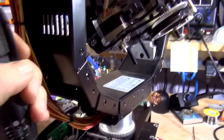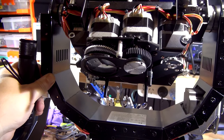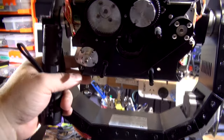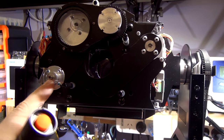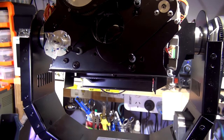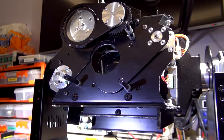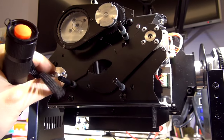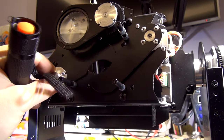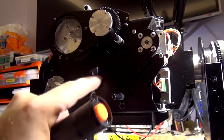On the other side is where the harness is, and that's it. It's a very simplified version of the other light. In the head, the shutter uses two stepper motors — one here and one here — instead of having one like the other light. They're connected in parallel and they drive together.